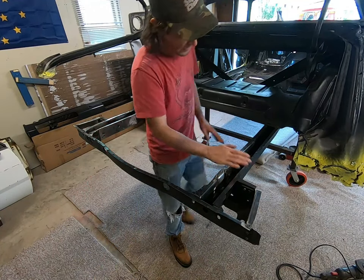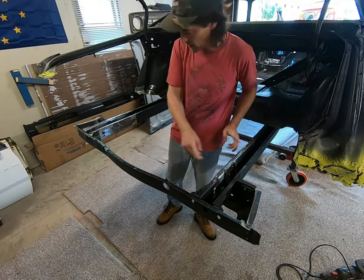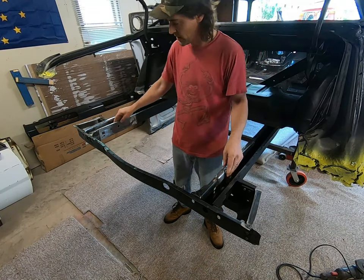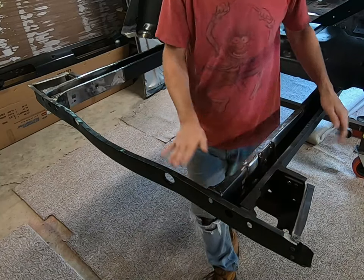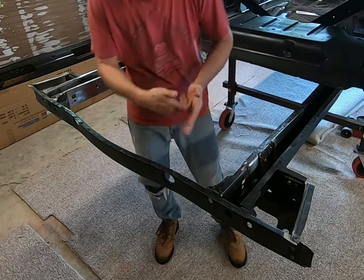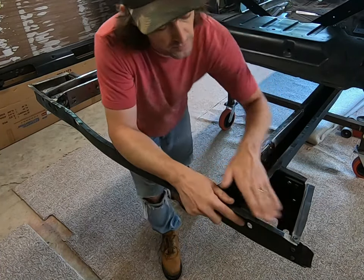So we got that welded up and we have a couple more things to do. We want to get this prepped up to accept weld. This area here — this is where we added some new metal. We added an entire frame rail section from here all the way to the cross rail back here, a new piece here and a new piece here, and then we put all the OEM stuff back in like this brace and bracket — kind of just rebuilt it back the way it was stock. These areas here, this flange, anything that's bent down like that — all the rest of the frame rail — must be taken down to bare metal because that's gonna be the surface for the weld where we drilled our holes. The same thing we did for the passenger floor pan a few episodes ago.